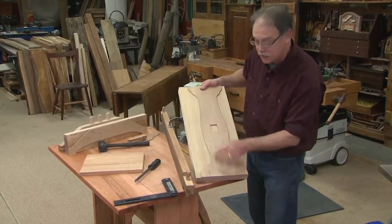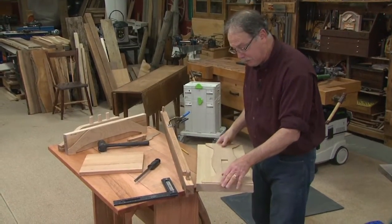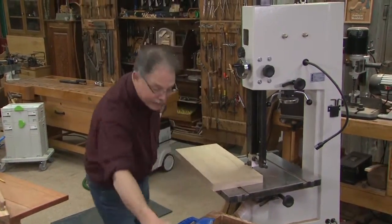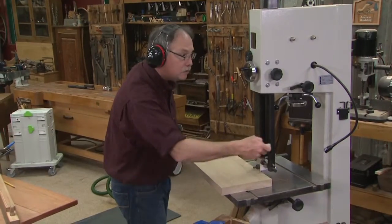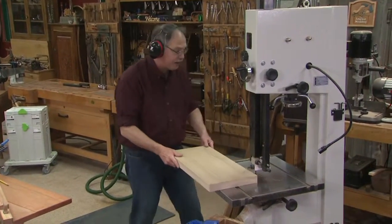Take a look at this pattern — it's balanced left and right and I have a mortise here that I'll cut out with a saw later. Over at the bandsaw now I'll sculpt in the shape, following that around and leaving the line so I can sand down to it. Once you start a cut, flow with it — don't do a notch cut to get right back, it'll make it rough.